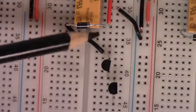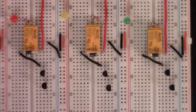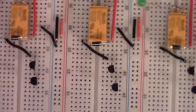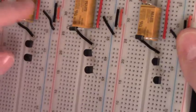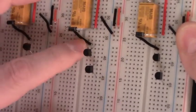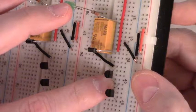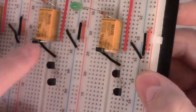We need to repeat this procedure for the other two circuits. The end result — your board layout — will look like this one. We can take care of these connections where each collector of all the upper NPNs is connected to the wire — the low side of the coil — and the emitter of the upper NPN is in the same row as the collector of the second NPN in each case.